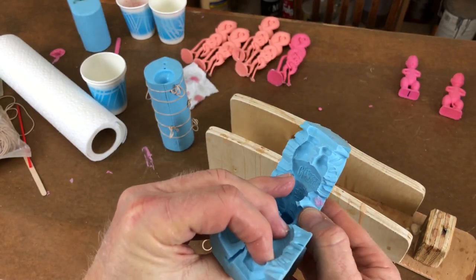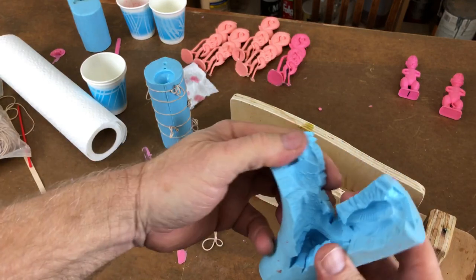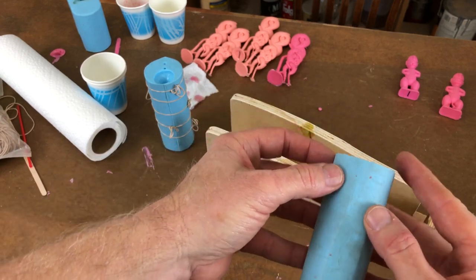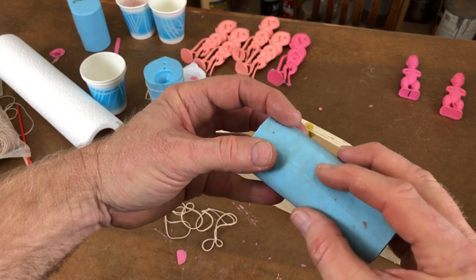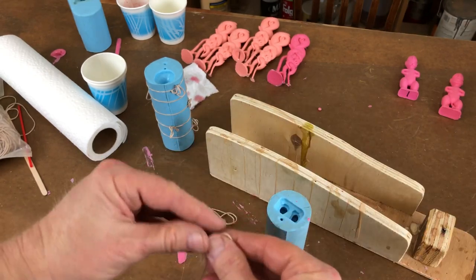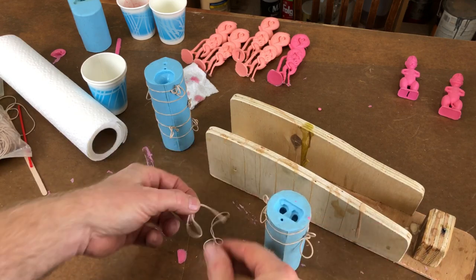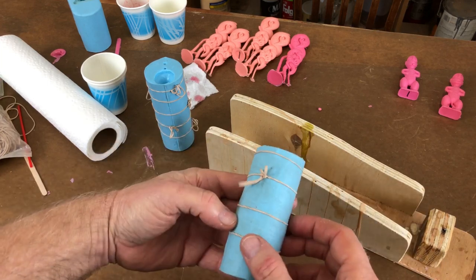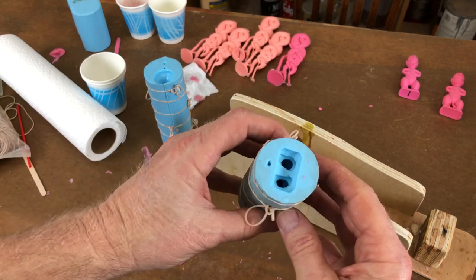One of the things I do is keep the molds clean. See how there's a little bit of flash in there? That'll just build up, so you want to get that out. I blow it out, I scrape it — it's really very minimal cleanup if you do this right. You want to make sure those parting lines fall together and lock together. We don't want to spend any time cleaning up castings — the less work you do in life, the happier you are. Even when I'm working on professional jobs, those are less fun because there's a little more worry.